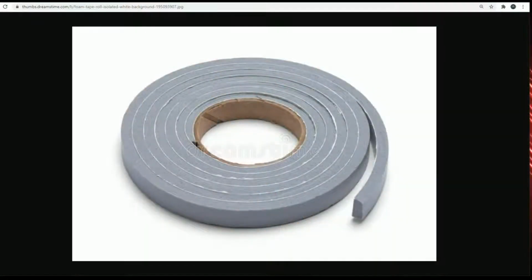One of the best things to use for those is foam. It's sticky backed foam weather stripping. It comes in a roll. It's cheap, and if you'll just take the time to put that around that door, so when it closes against that foam, you can make a huge difference in the comfort of your house and in the smell. And that's the main thing.